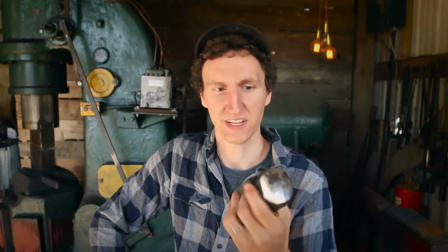You're like, well, Tim, why don't you just spend 4 minutes and take another heat on it? To make this one heat hammer, the actual forge time is only like 5 minutes, but the setup takes quite a bit of time. Just to cut the material, because it's coming out of that weird shape, is about an hour. And then you gotta dial your tools in, and you preheat the dies on the power hammer. The forge has to be really, really hot. So anyways, it all adds up to easily half a day or more, with handling and everything else. And I'm just pushed right now.